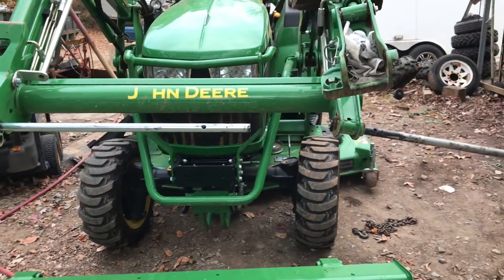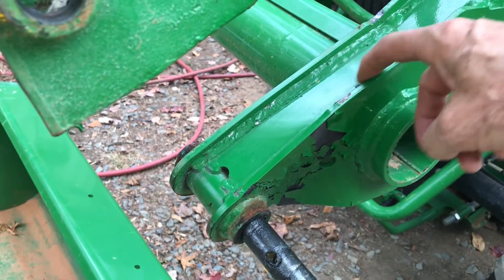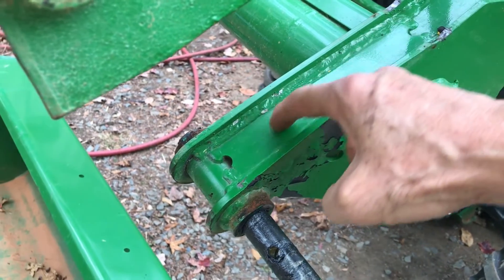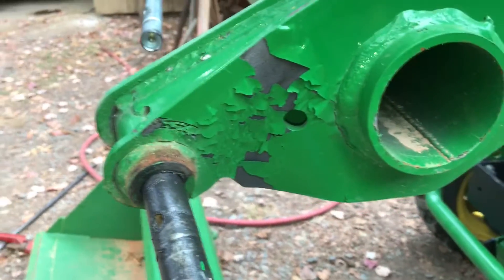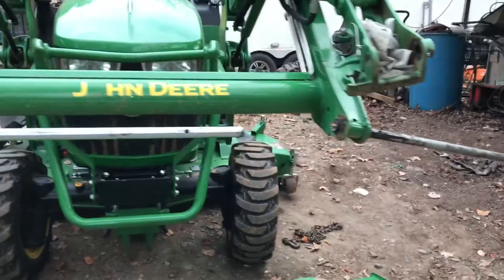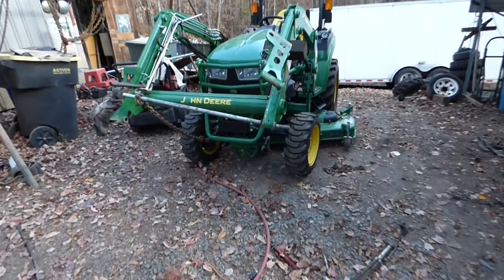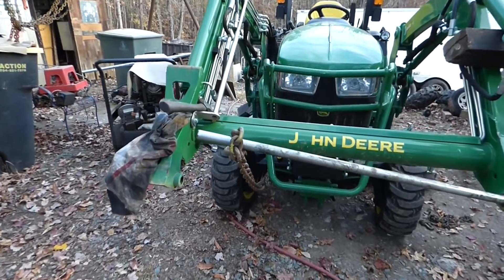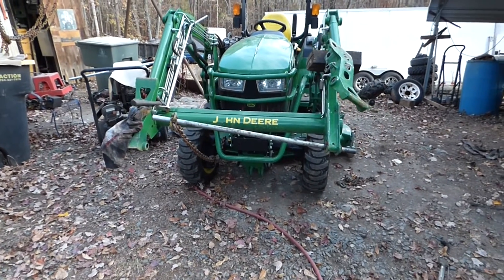He brought it over and asked if there's anything we can do to help. What we're going to do is try to heat this up. If we have to, we'll cut this weld here and remove this plate, or cut a groove down the middle of this and then weld that back together after we straighten it out. You can see that's in pretty rough shape. We've got the torch set up — we're going to heat that up, start the tractor up, and we've got that chain hooked to the front axle, which is stout. We're going to lift the front-end loader and hopefully bend it back into shape.